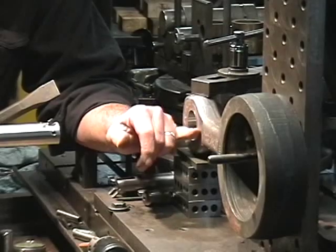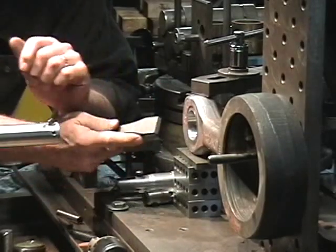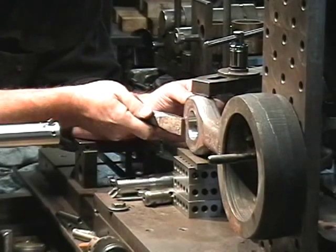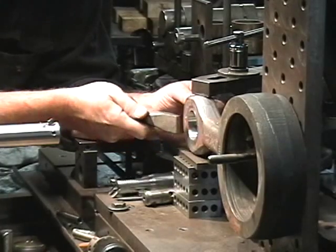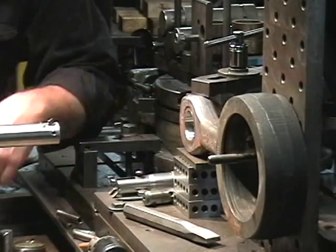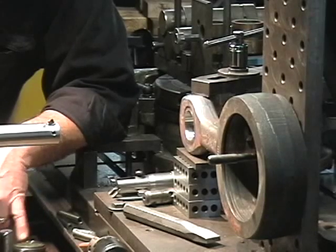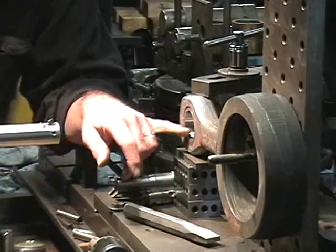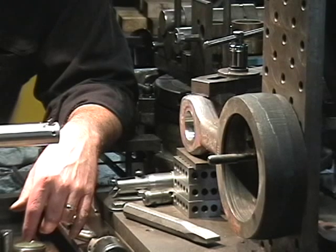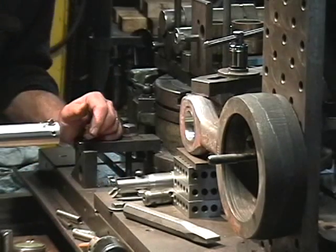With the welded bores, they look like they need cleaned up a little bit — you grind a chisel up like this and the bugs come right off. Of course it helps if it's clamped, but the chisel will pick underneath the bug and just knock it right off. They're ready to go. I hope this wasn't too confusing — that's how I set this up. I actually get chips to break on welded bores where they're kind of tough, like boring T1. It doesn't like to break a chip, but if your tooling's right, you can do it. Have a good day.